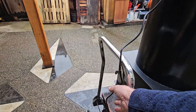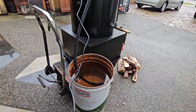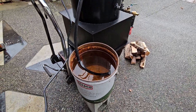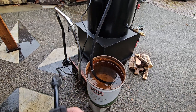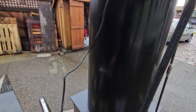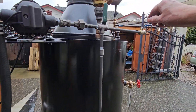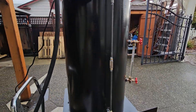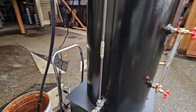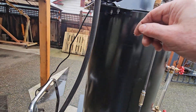I'll turn it on — I always keep this cord away from the boiler firebox. Got a little bucket of water here, and this is the on-off switch for the pump. You can just barely hear it running. If there's air in the system, just use the bleeder valve. Now everything going into it is going into the boiler, right down into it. I don't want to put too much water in right now because that will kill the steam.